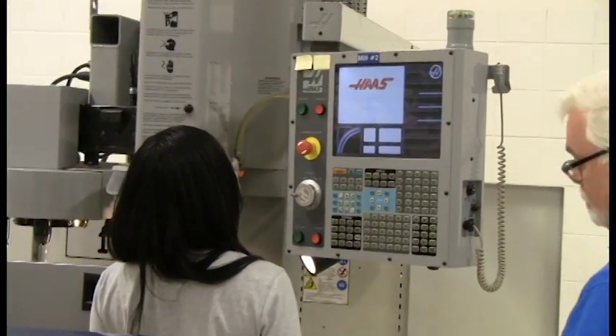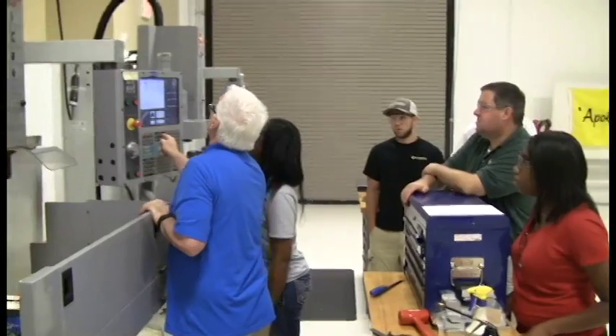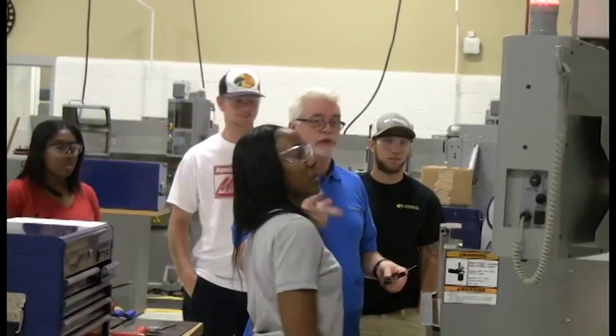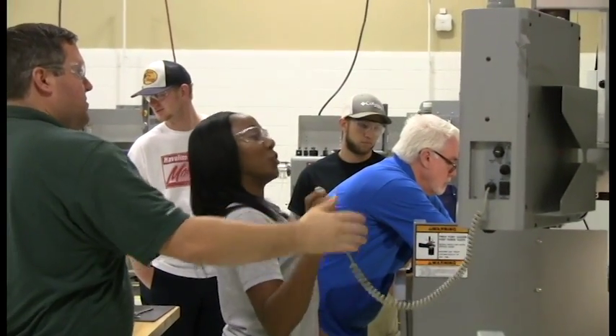So then everything is measured from that one spot. She runs it again through graphics out here to make sure nothing's changed in the meantime. Now we're at real time in real life — touch all her tools off to know exactly where they are, and then step through the program. They step through it being very quick. Any mistakes they hadn't caught before, they've got to catch them or it creates a crash. So you have to keep your fingers on the go button and the stop button, and anything you see that maybe doesn't look right, you've got to stop it, think about it, and catch your mistakes.